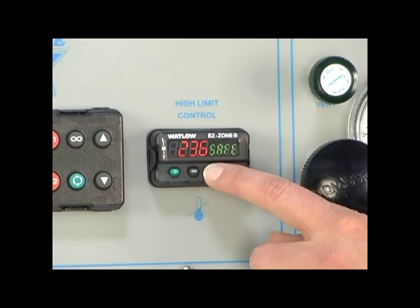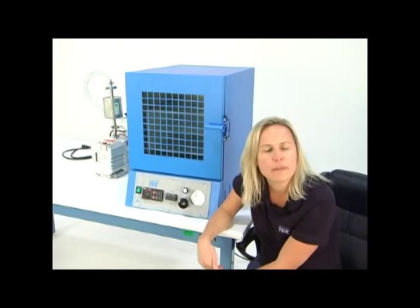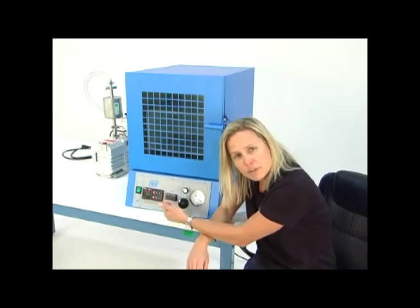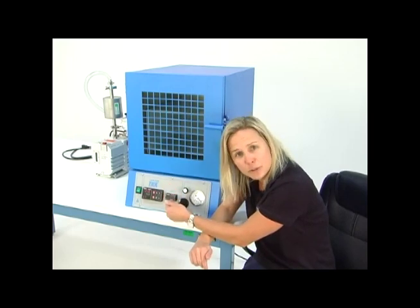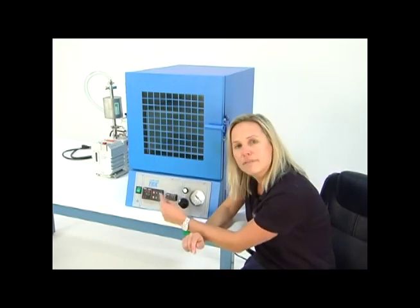This little guy here is what's called a high limit control. This is a fully independent digital overtemp fail safe. For example, let's say that you have something you're putting in the oven that is very expensive or heat sensitive and you absolutely do not want that part to see a certain condition. You can set this limit or overtemp fail safe protection to make sure that the oven does not ever see that temperature. Should a runaway condition occur, this will take control of the oven and actually cut power to the heaters — which is sort of unusual; as you're looking for vacuum ovens, ask that question. This overtemp not only gives you a specific accurate temperature value that you can say do not go to, but it also actually cuts power to the heaters rather than just maintaining temperature. This is a great fail safe device to have on a vacuum oven.